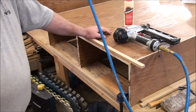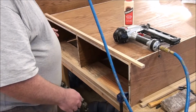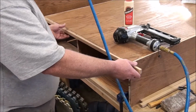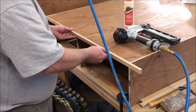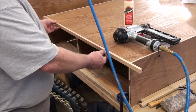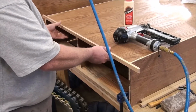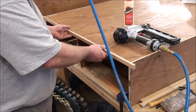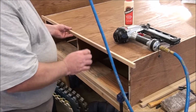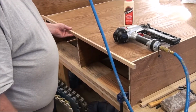So that means I would have to use a caul. What a caul is for is because you need clamping pressure. You can't just have one clamp here and one clamp there, because wood bends, right? And you wouldn't get any pressure at other points here. So your glue wouldn't be pushed right in and going to adhere properly. So a caul,